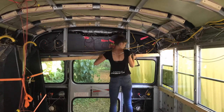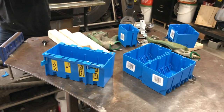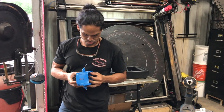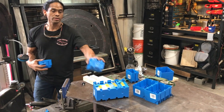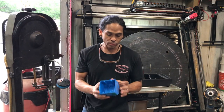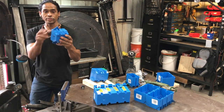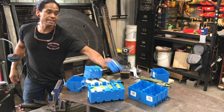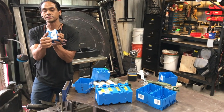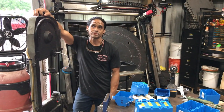I'm gonna put the frame like that so I can put our blue box in — but they were way too large. Because we didn't use a 2x2 for the frame strip, we used a thinner option for thinner walls. But it's hard to find a thin box. We went to McMaster-Carr and found the best options, but still had to do modifications because these are made for houses, not for buses. So I'm basically gonna cut it off and put L-brackets. These are great except for these ears right here, so we're gonna modify them so it fits our bus — hopefully within code.